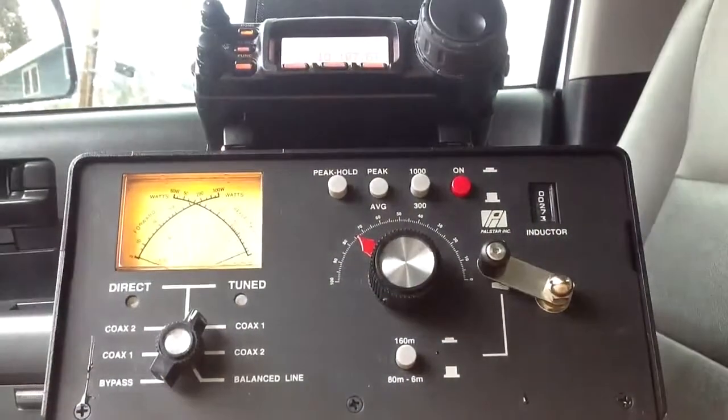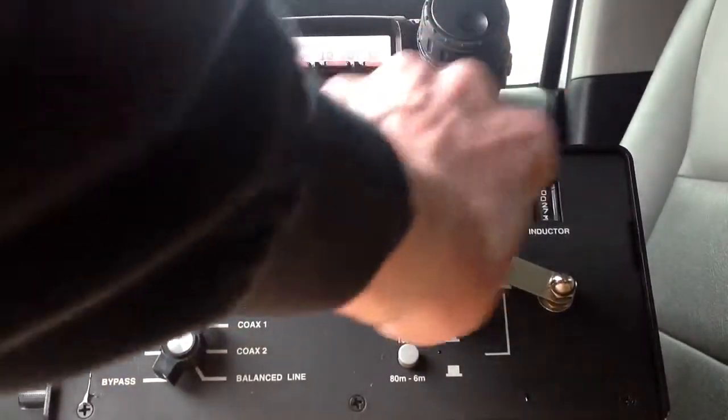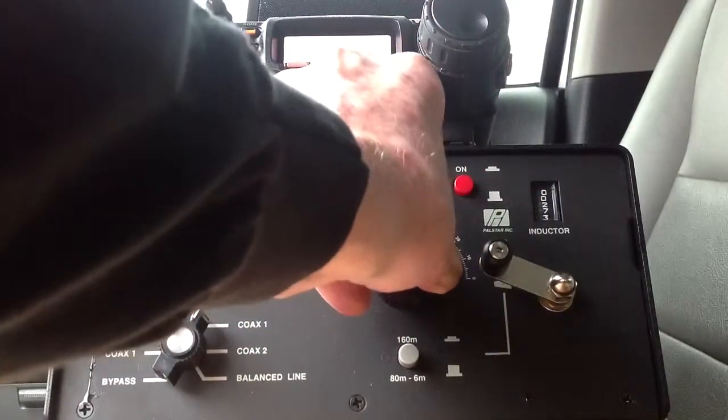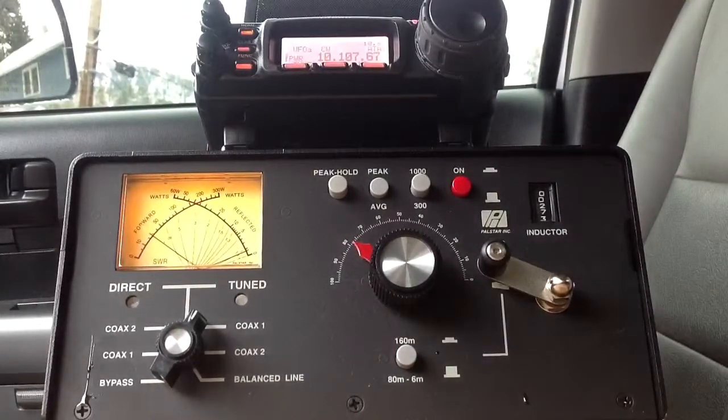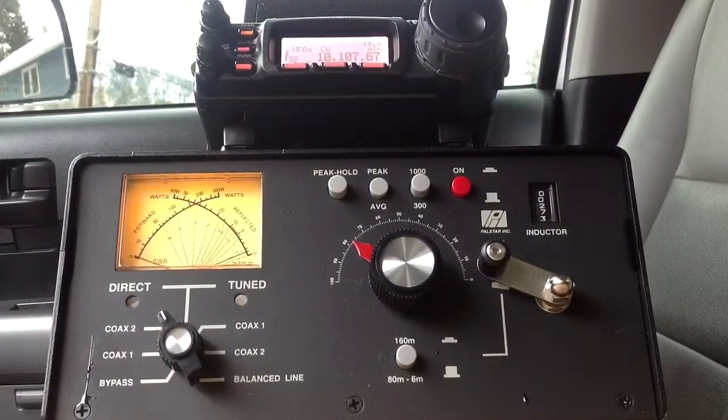The noise level is much weaker — look, S1, S2, S4. Notice I had to tune the capacitor just a little bit different there — it's up to 78 now. Those are just preliminary settings. But notice the noise level now: S1, S2. This is the band on which the ATAS, which we're now connected to again directly, greatly outperformed my whip.